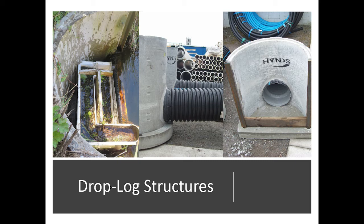If you've got connectivity to areas with pest fish, you don't want to get pest fish into your wetland — especially koi carp and that kind of thing. It's actually a good option to put water control structures in. If your wetland is going to fail, it's around that pipe going through your dam wall. It's a maintenance thing — just keep checking on it. But now instead of having a smooth pipe, we use ribbed pipe and we get very little tunneling anymore, so failure is a little bit less.